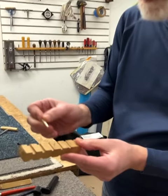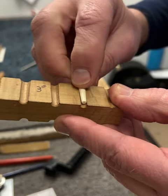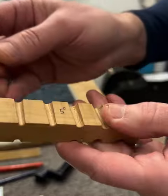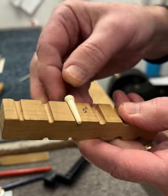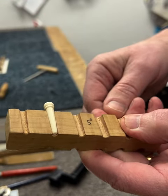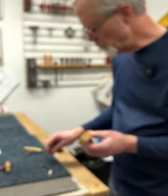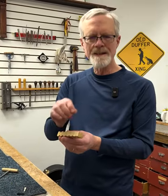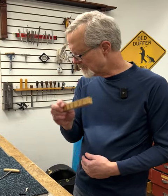Let's take this white pin and put it in that same slot of the three degree. Doesn't fit down as far, and you can see that little bit of wiggle at the bottom. If we try it in the five degree slot, it's pretty snug. So there you go. Even though it's not super accurate, this visually helps you to see different things. That jig is very handy.